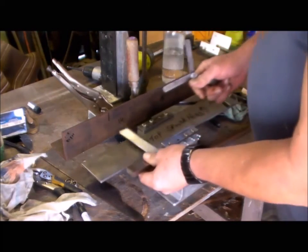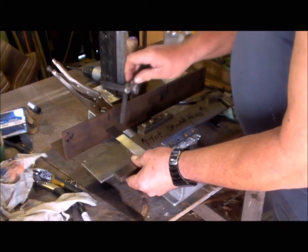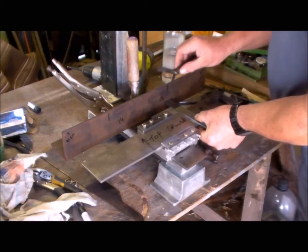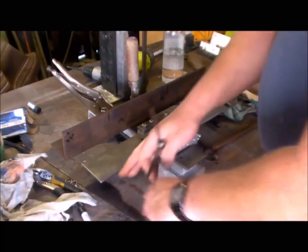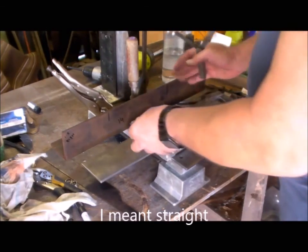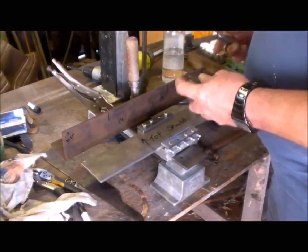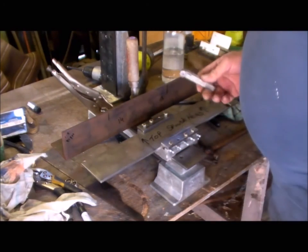That's 14-thou, so there's a 2-thou difference there. I've also checked this front edge to make sure it's square. I've rechecked the squareness of this angle to the base — it's square. So I'm going with 2-thou. I'm not going to correct that. I need to file the inside surface — 2-thou — I'm not going to worry about it.